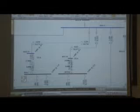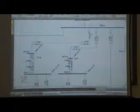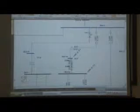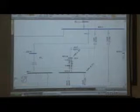So, now we know the load flow, and what happens if I open this breaker? It's open. Well, what do you know? There's no load there. Well, that's a good sign. That's what you wanted. So you say, I'll write that down or keep a record. The first thing I'm going to do is open that particular breaker. That will kill that bus. And yep, the entire bus is dead. There's no power flow there.